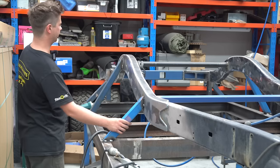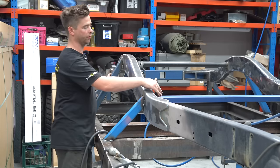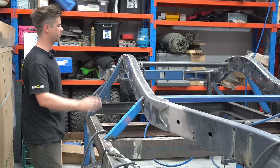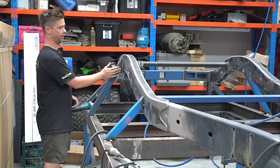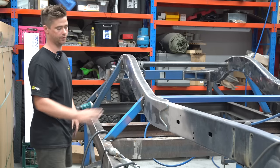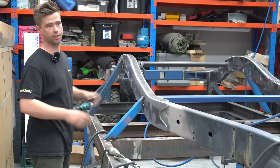We've added a brace in here so we can cut the other one out. We're going to do the same on the other side and move this temporary crossmember to the middle, so we can finish blending the internals of the rails and this last section we can't blend due to the brace. Then we'll chop the backs off, leaving just four points holding it on, so we can completely finish the chassis and continue on with the build.